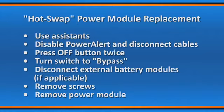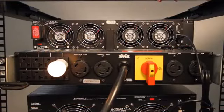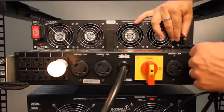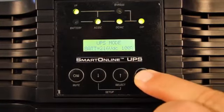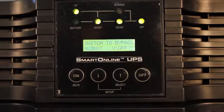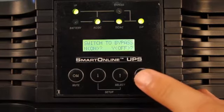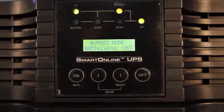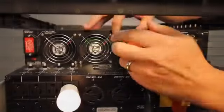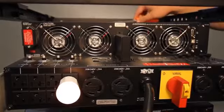Use several assistants — all modules are extremely heavy. Attach a PDU hanger bracket for additional support if needed. Disable power alert software and disconnect communication cables. Press the UPS's OFF button until you hear a beep and see the following message in the LCD display, then press the OFF button again. Turn the PDU's bypass switch to bypass. If an external battery module is connected to the UPS, disconnect it. The UPS module is now safely powered down and can be detached from the PDU.